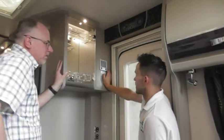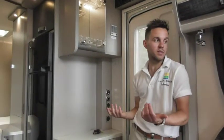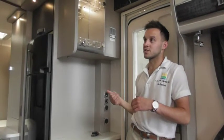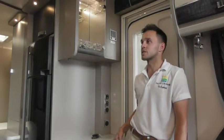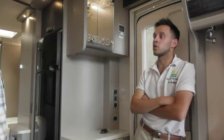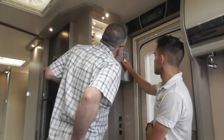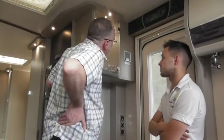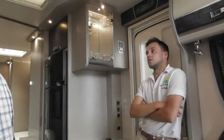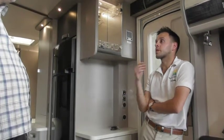The timers are next to useless because every time you take mains power away from the caravan, the timer reverts to zero — the clock goes back to midnight when you attach power back to it. So you've then got to go through and set the clock and everything again. You're better off leaving it like you would at home, just having a thermostat on and letting it come on and off as you please. If you don't want the heating to come on while you're out, just go in there and press off. A comfortable temperature if you're sat in the van at night is probably about 19 to 20 degrees — just set that at 19 or 20 and if it drops below that it will just fire up to warm the van back up.